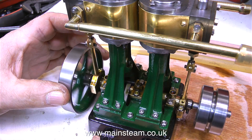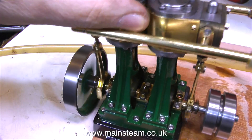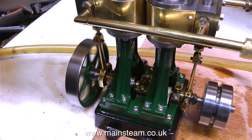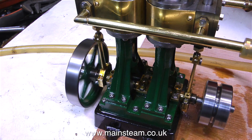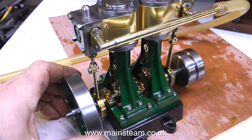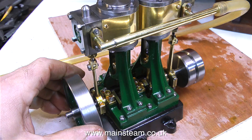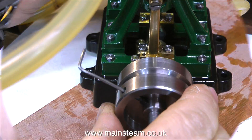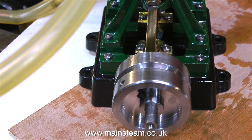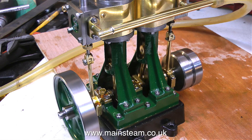However, by very, very carefully adjusting the position of the valve, I do get the engine to run very well in the end. The engine is sat on my soundboard — I always put the engine on a soundboard so I can hear any spurious knockings. When I lift the engine off the board, it runs quite smoothly and without a lot of noise, and as you can also see it runs very slowly. The oil is fairly thick — it's not machine oil. This engine is still going to blow slightly because the valve events are never going to be right with the ports shaped the way they are, but I can get it to run well enough for a model steam engine. I've also moved the position of the flywheel and the small flywheel closer to the actual eccentric — that way there's less chance of bending the crankshaft — and as you can see, the runout on the main flywheel has more or less disappeared. I turned it round because I didn't like the ugly allen bolt sticking out at the end.